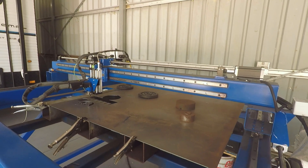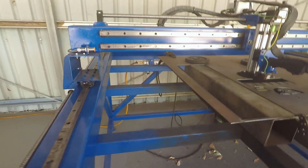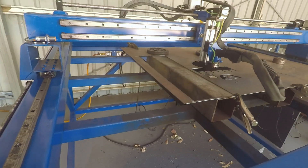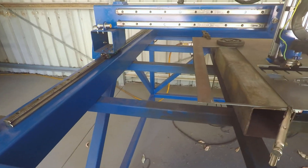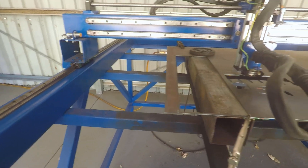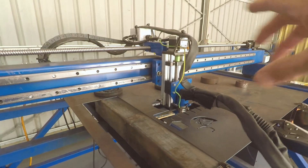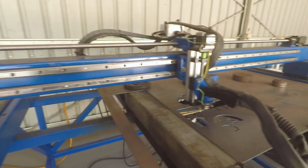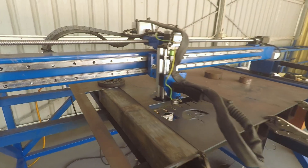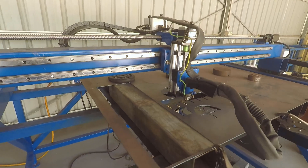One other thing I need to do is install a drain and valve in the bottom of the water pan. This frame is 1600 internal by 1600, so the pan is only 1500 by 1500 — more than I need, but I wanted it a little bit oversize. From the previous videos, this torch assembly has a cutting area of 1340 max on this gantry. A standard sheet of steel is 2400 long by 1200 wide, so I've got more than enough room.